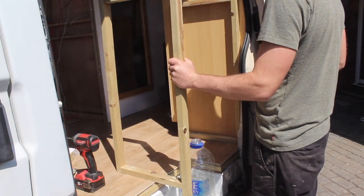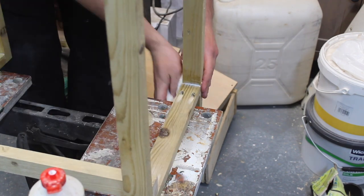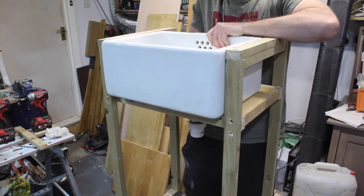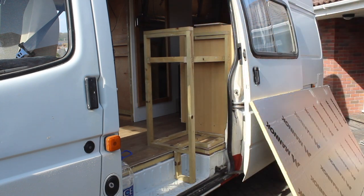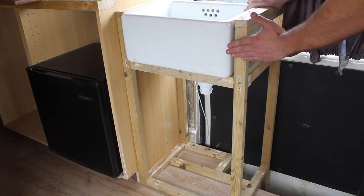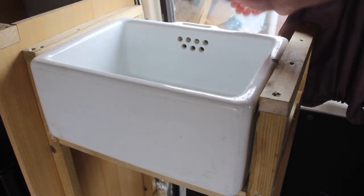I've got two frames and that's going to go in there. I just want to put a bit of glue on these pocket hole joints. That's the bare bones construction of the sink unit. I've put a batten piece around here just to hold the sink in position inside the unit so we've got an even space either side of the sink and it overhangs the front of the unit. I've built the top of the unit level with the edge of the sink so that when we put the worktop on it will sit on top of the edge of the sink.